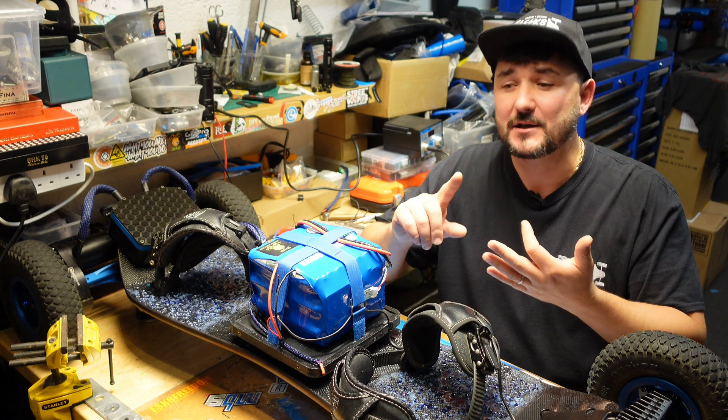This is actually an LED driver — it senses what voltage the LEDs require and gives them exactly that. Very smart. Another good feature: they're tiny — only 35mm long, 20mm wide, and 12mm deep. I have two of them because I have the LEDs on the box and the front lights. One for each light source means each one gets the maximum amperage it requires to be at full brightness capacity.